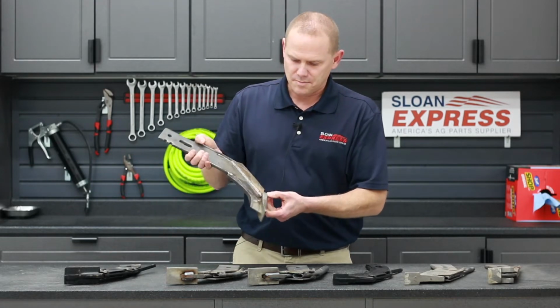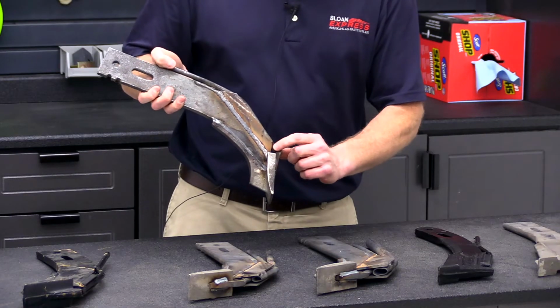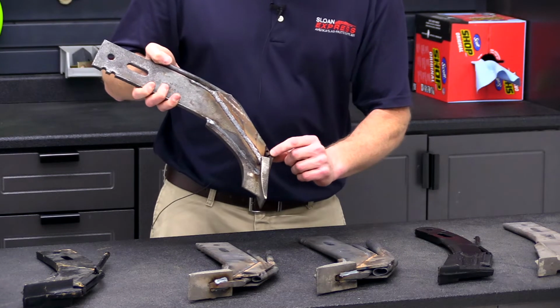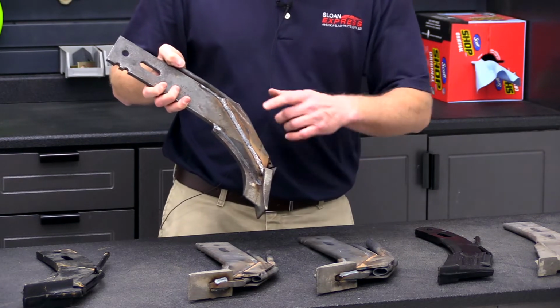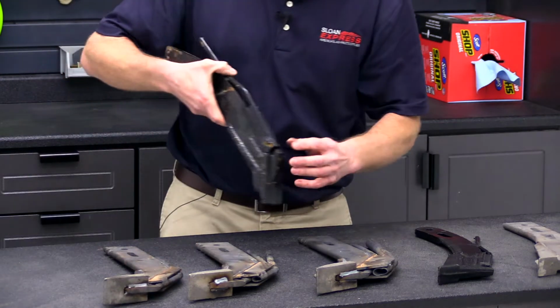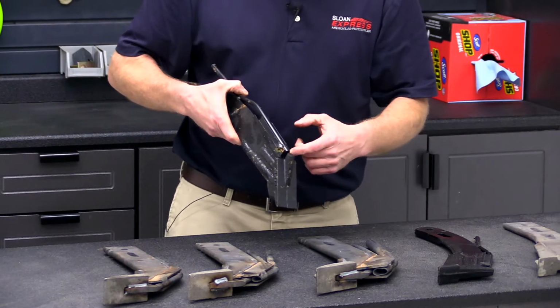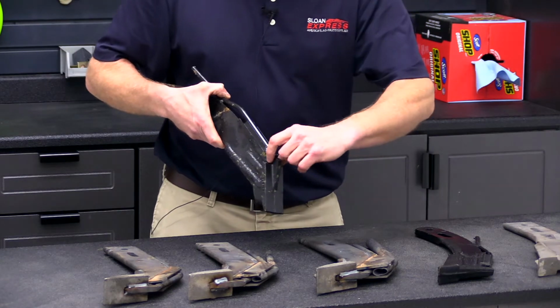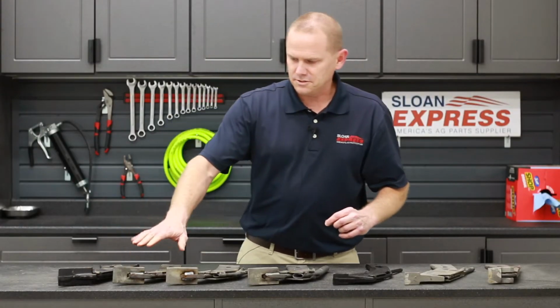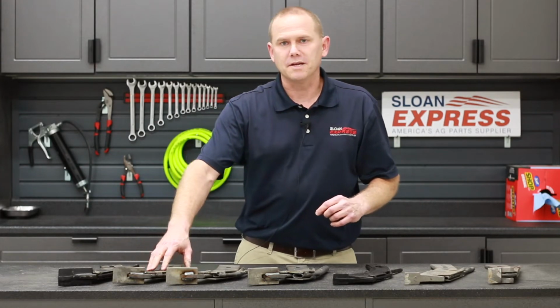The other thing that's the major difference is on the back side where the tube comes down to push out the anhydrous. Hypro actually pinches that a little bit and then they drill a hole through to help that anhydrous squirt out the sides, where the Weiss one is just open, basically an open tube to just let that anhydrous draw out right into the ground. So just going over those, these both have single 3/8 tubes on them.